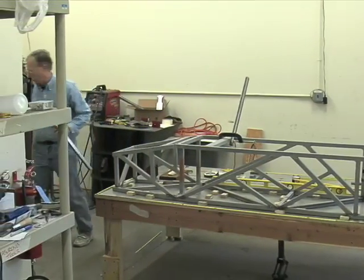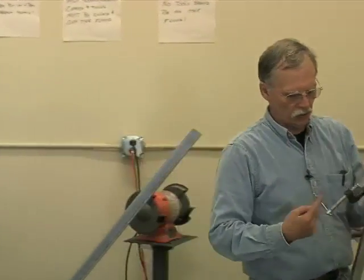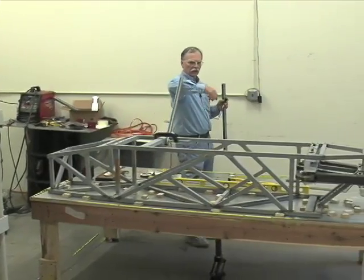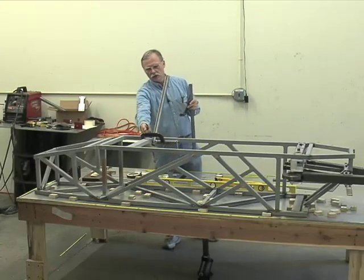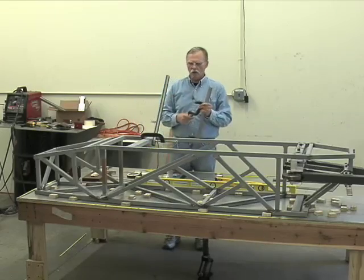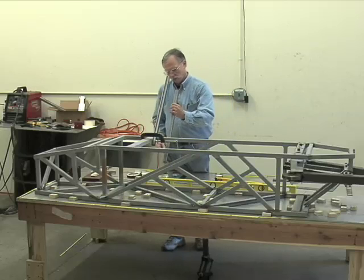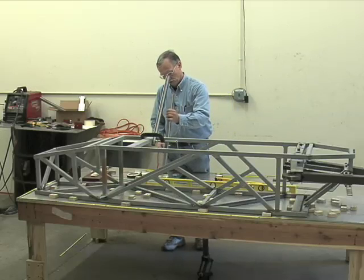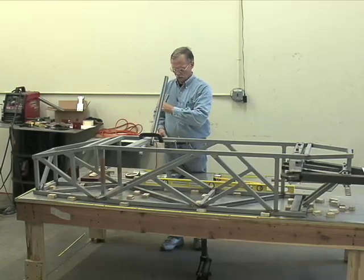Because if I just left that and tried to weld it without the other piece to triangulate it, if I just accidentally went boom, it moved. And if the welder comes along and welds it, it's all off. It's all screwed up just from a simple bump. So what you want to do is find a nice convenient place to come off.